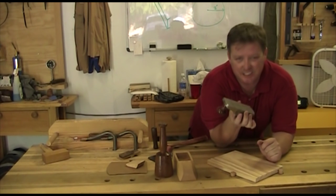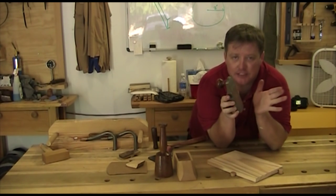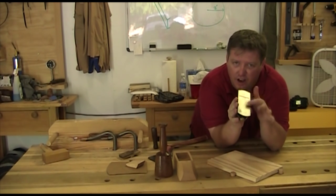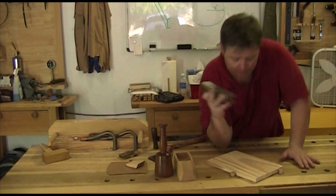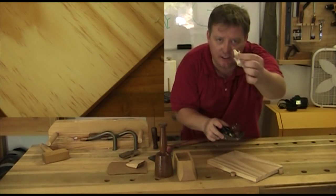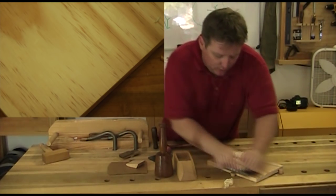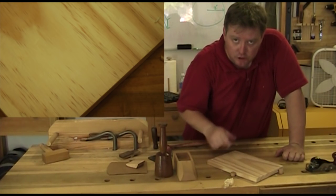So I have my block plane here, which I actually use as my main smoother — it's just easy access right behind me. I purposely sharpened this blade straight across. So even though I'm taking just a fraction, maybe a couple thousandths of wood off, you're going to see plane tracks on the end result. Let me show you a picture of this right here after I do a few quick planing passes — you can see through these thin shavings. This is what frustrates a lot of people trying to go for a finish-ready surface right off the hand plane.